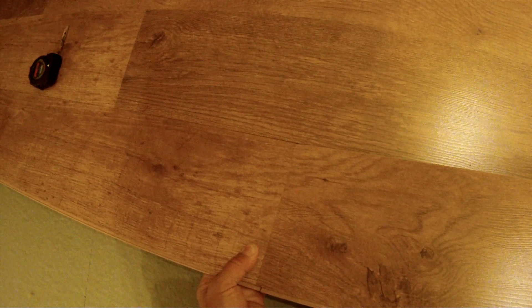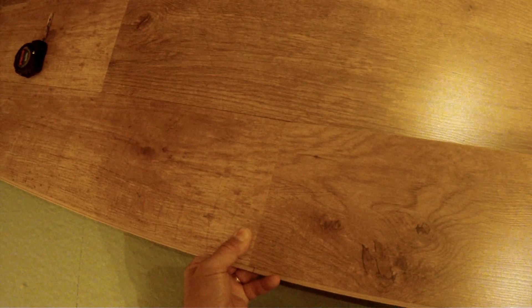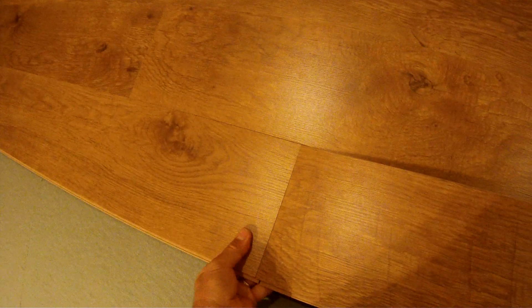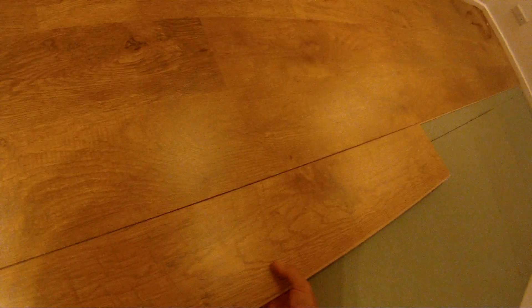What we have to do is slightly tilt up, slightly pull out the previous board, and then get the alignment from one board to the next — from the left piece of board to the right piece — exactly right. Make sure this lines up exactly because it's very difficult for these boards to move up and down with respect to each other after they've clicked together. These aren't fully clicked in yet because you've still got a slight angle, but it allows us to get the whole line done on our own. Then to finally click it in, give it a little tap with a hammer and a block.